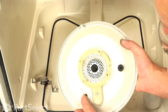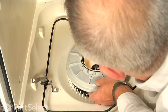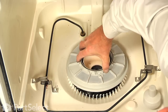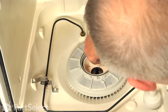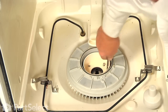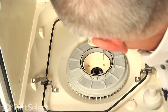If we look at the bottom of the separator, you will see that there is an oval opening that is going to sit right on top of that little gasket that we put in place. Line it up roughly, and we are going to lift up on that rear manifold, slide it over top of the drain impeller, drop it down into position, and rotate it. Once we have the separator lined up with the screw holes and the opening on that pump, insert the four screws and snug those up without tightening them to make sure we have all in the proper spot. Tighten them diagonal to each other, and then tighten them up securely.